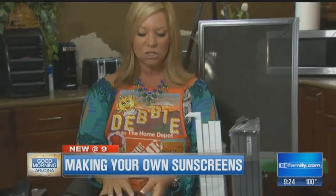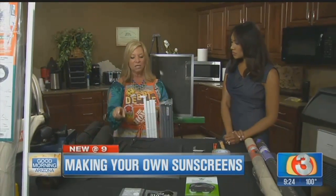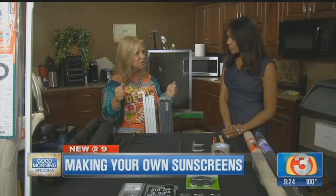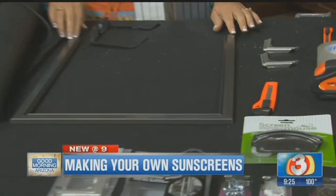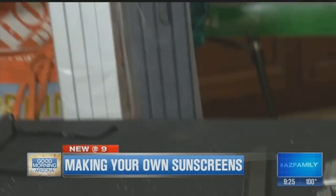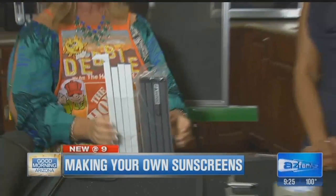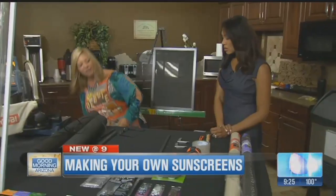With sunscreens, because the sunscreen fabric is much heavier and much darker, you need a larger frame — and it makes it really sturdy as well. So these are 7/16ths in size, and this is the frame you would need. You can use the smaller frame for sunscreens, but it's a lot more difficult because the spline is a lot thicker and it's hard to get it in there. So we're going to use this larger frame.